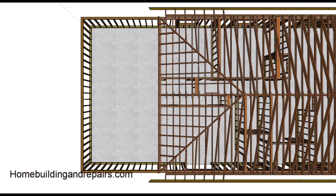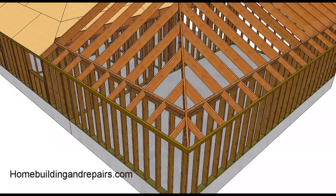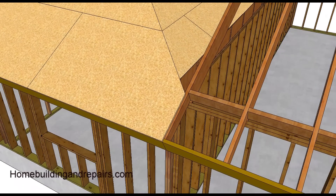Home addition walls, existing building, and existing roof — here's where the magic begins. Here's the roof sheathing that would be cut over the blocks; you actually need to nail the sheathing if it isn't already nailed. Here we have our roof ridge sitting on top of the existing sheathing, our two hips, the fascia board lining up with the rafter, the blocks, the little flyers, and then our fill rafters or jack rafters.